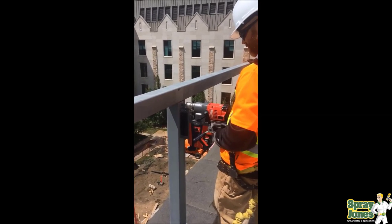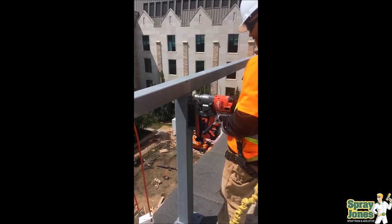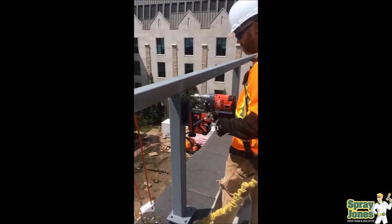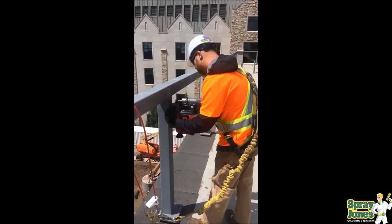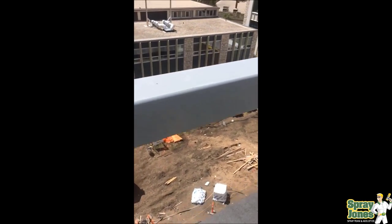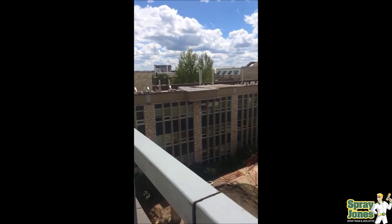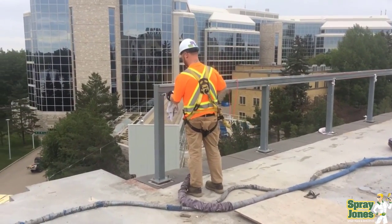This was a 2017 project. This drill had been on the market for about six or eight months, but seeing that it was M18 powered was just amazing to them. So we're drilling out all the holes, and then what we're going to do is switch our rig over to a closed cell 2-pound density pour foam. We're going to use the same air purge gun, but with a nozzle on the end that's going to allow us to inject into these columns.